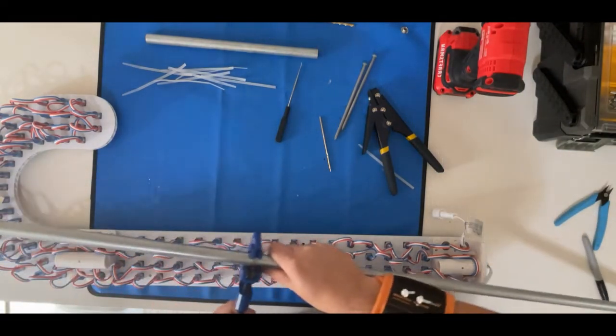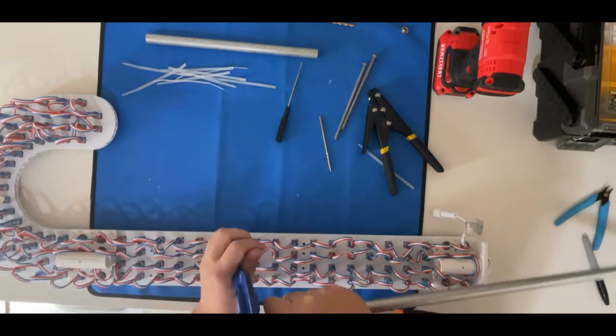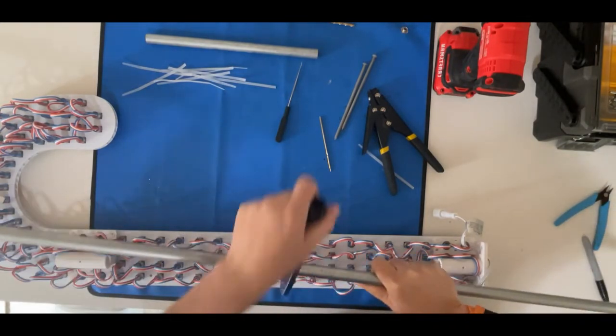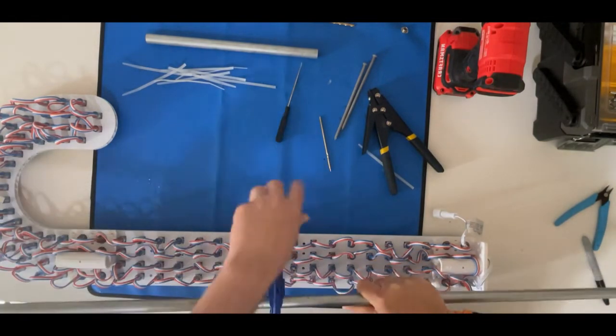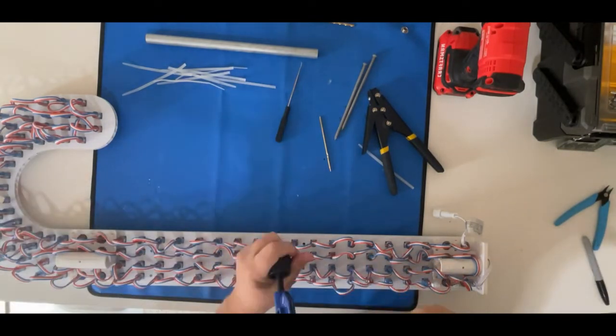It's just a matter of turning it around the pipe. As it gets slack, then you take and turn the handle and tighten it up a little bit more. And you just keep doing that process all the way through, and eventually you are going to cut all the way through this pipe without needing anything special. Just a little bit of hand strength.